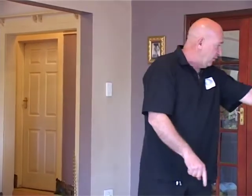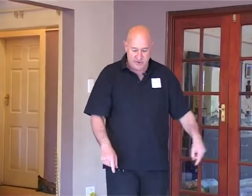Guys, you won't believe this is the same room where we started earlier on. With all the termite, the rotted beams, all the moisture, all the problems we had here. This is now the way a crawl space has got to be handled according to SAWLFA, South African Wood and Laminate Flooring Association. Now we have the subfloor, all the plastics are in, and this floor will now be good for the next 100 years at least. Remember, the 5 millimeter gaps around the ply, of course also the same gaps around the edges.